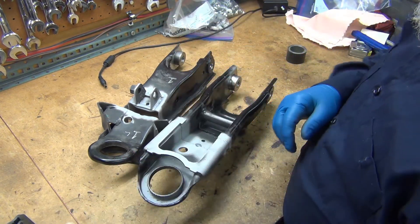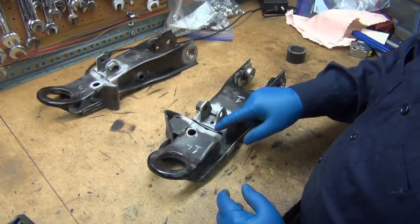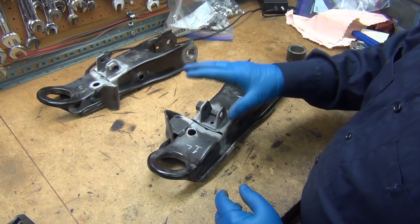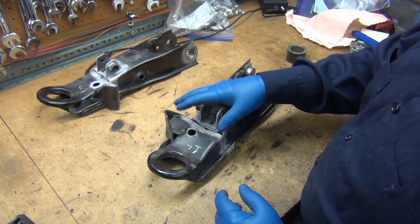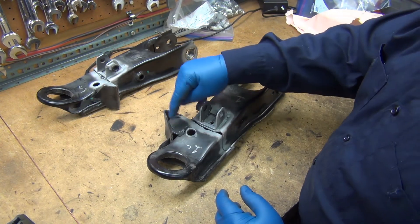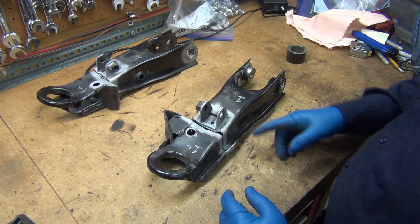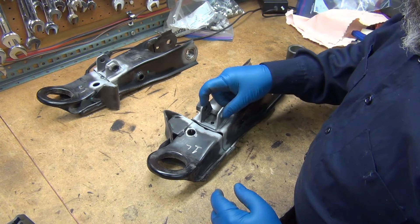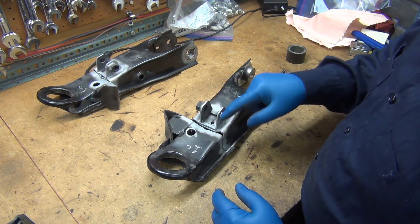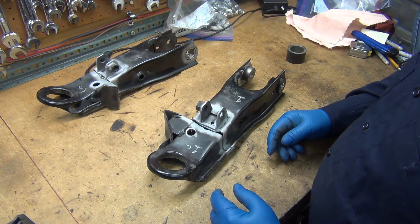So this arm is done and ready to go. I didn't know exactly whether you wanted this left in to help reinforce or cut all the way out. Just in case you decide to go to coilovers or bags — I know you're going to go bags — with bags you're probably going to have to get in here and possibly cut out some of the steering stop anyway, so you can just slice those off wherever you want. The rest of the guys I'm going to have to cut the nut off here and weld the reinforcement tabs on — for the ones that get tacked out the door, they'll just get tacked in three places and can get finish welded by the customer.